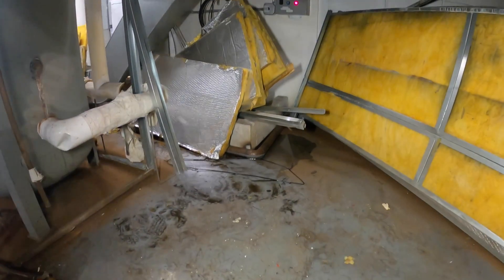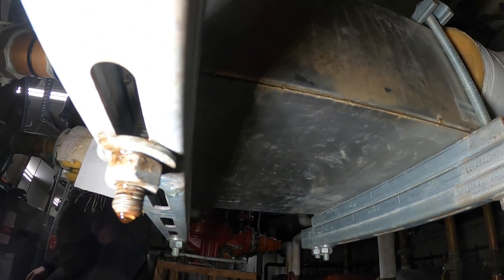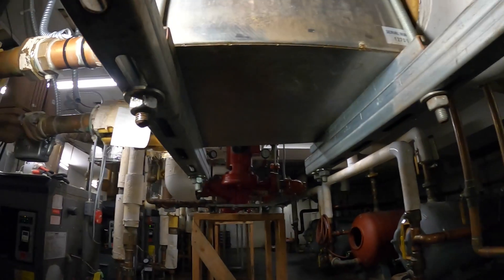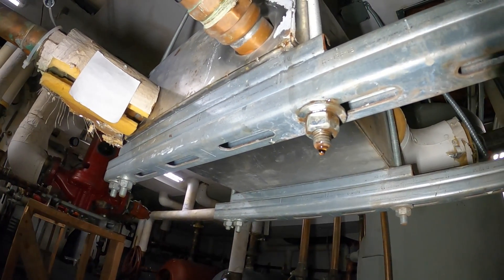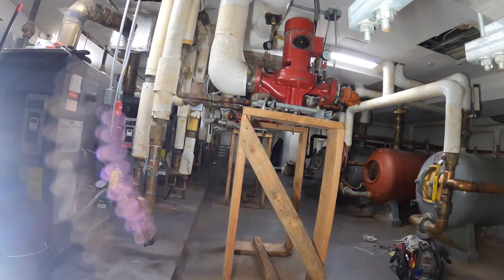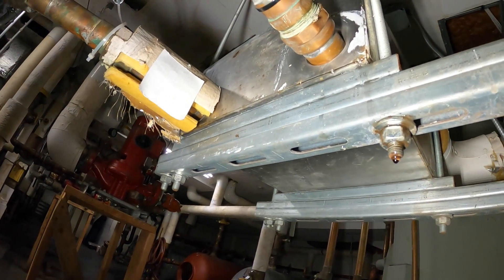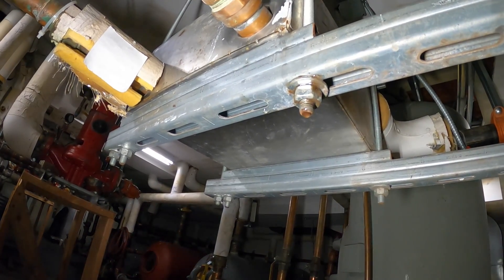But we just noticed something — this thing was leaking some water. Right there, there's a little bit of water on the floor. It's the heat exchanger leaking. You can see it in a little crevice here — something inside is leaking, it's not any of this piping, it's the heat exchanger itself. Man, after all that work. And we have another service call right now for one of those boilers. The pump separated from the motor and it's cracked. Oh man, there's a lot of work to do in this place. I guess we'll be busy for the next forever.